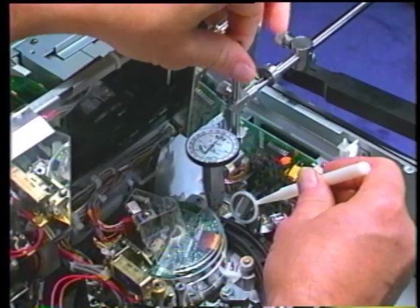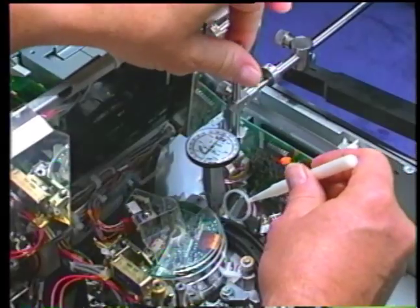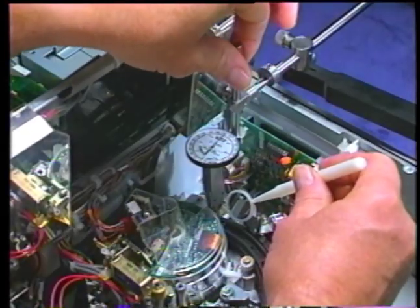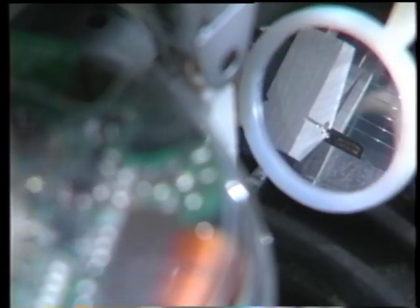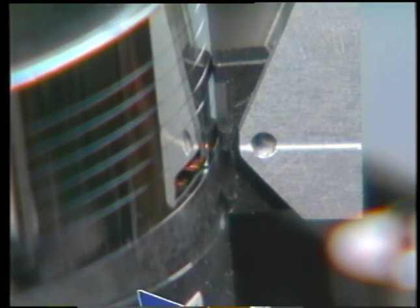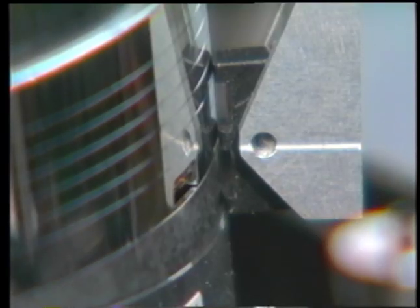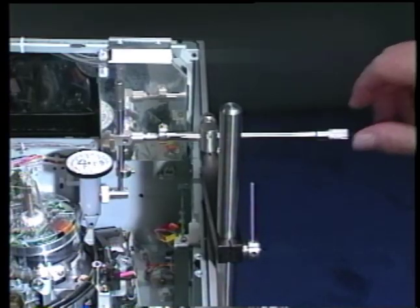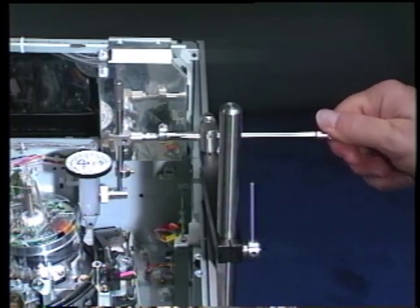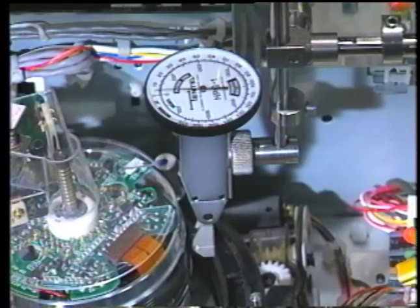When performing head protrusion measurements, the special self-aligning foot must be positioned across both the upper and lower drum. The head tips must be in vertical alignment with the center of the E-shaped measuring probe. The tape guiding rabbet, or small ledge in the lower drum, requires that the measuring foot be placed on the back right-hand side of the video drum. The micrometer adjustments of the XY slide allow the measuring tip to be brought into the correct position against the video drum, with protrusion readings starting from somewhere in the preload zone on the HPG scale.